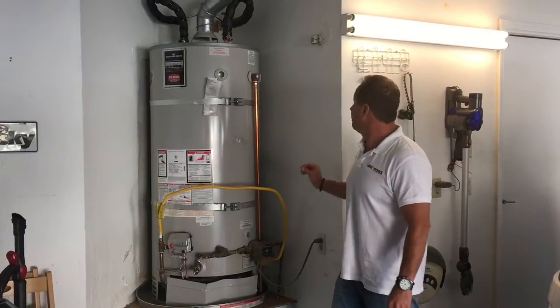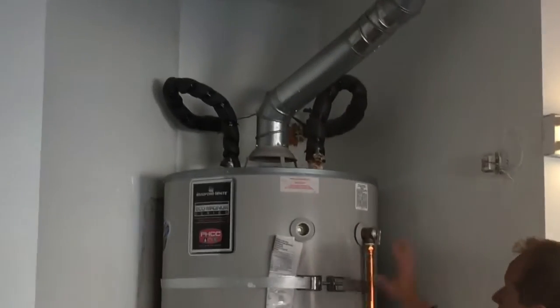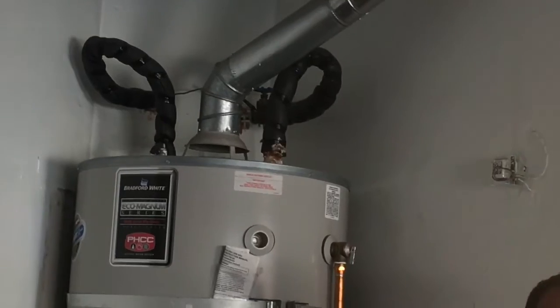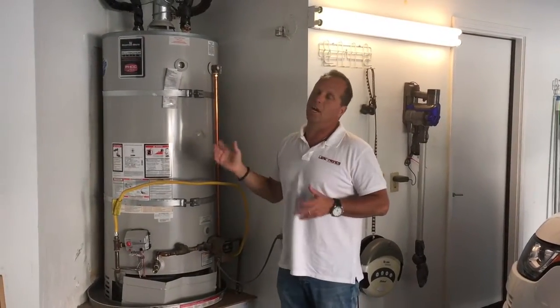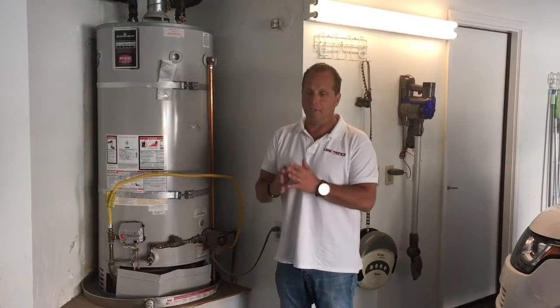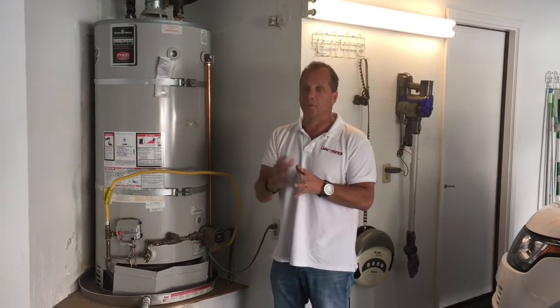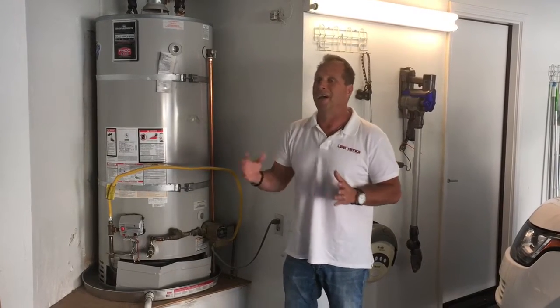Another method is being able to shut the hot water — there's a valve up there — and if we shut the hot water down to the house and then do our meter check, if it stops after we shut the hot water down, we know we have a leak on the hot water side. The equipment doesn't make much of a difference since we'll be checking cold and hot, but it gives you an idea of how to isolate.